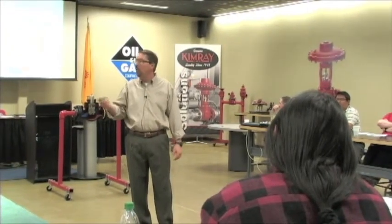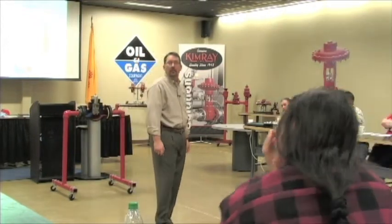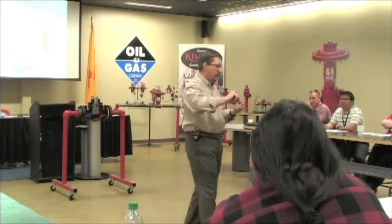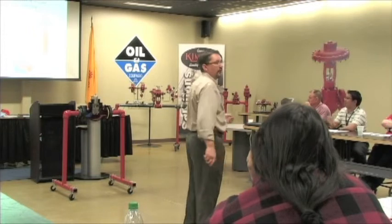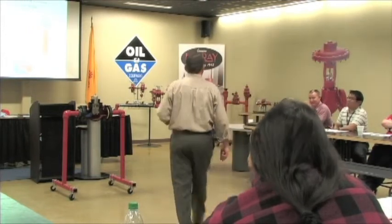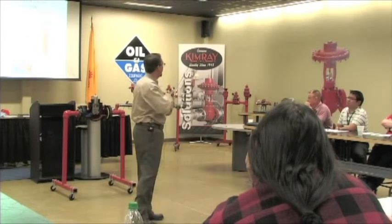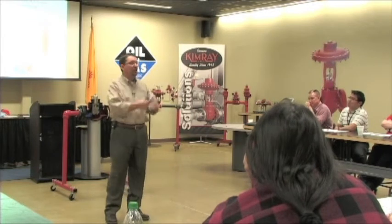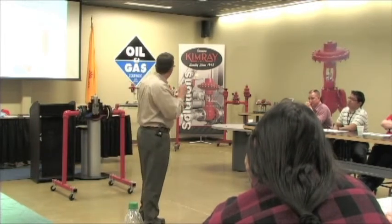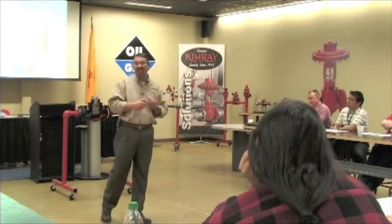The '3' gives you the pilot, the 'P' tells you what it's doing. Now you can buy these from the factory. You don't want to buy a motor valve, a pilot, a YAV, a 67 CFR, a sense line protector, or an overpressure protector separately — you want to just order it, put it in line. ECP 3P: 300-pound, P for pressure reducing. If it said ECP 3B...